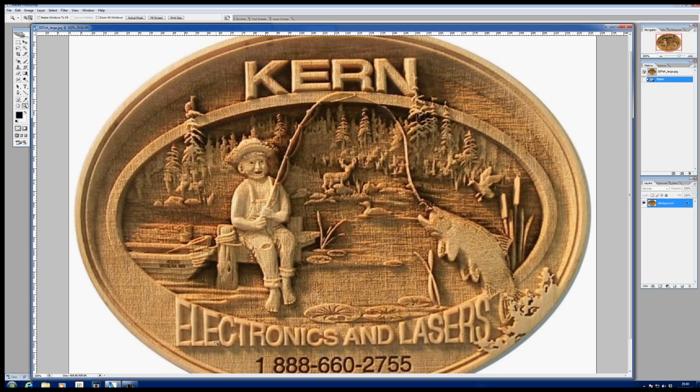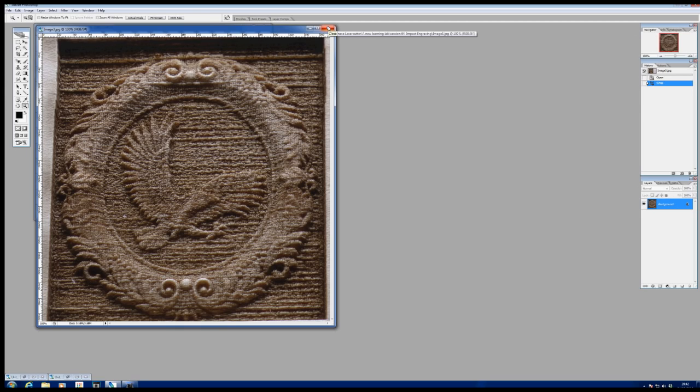This laser is a DC controlled tube, and that immediately gives me the impression that it should be smooth. For example, if you reach a certain shade of grey and that grey remains consistent, then I would have expected a smooth finish. Now, it might not be smooth because of the scan lines, but that's something you can deal with because you can take the beam out of focus and you can overlap the scan lines. But there's something going on here with the principle of glass tubes that even the best machine on the market doesn't seem to be able to overcome. That's what today is all about, trying to see if we can discover what it is about these glass tubes that we're running that can cause this problem.